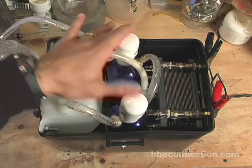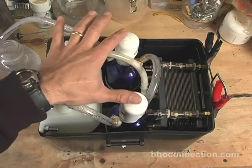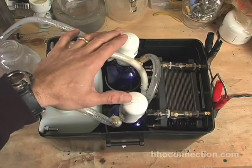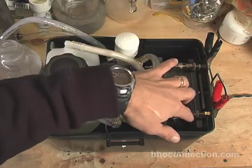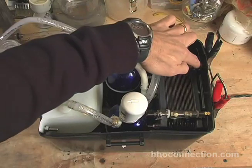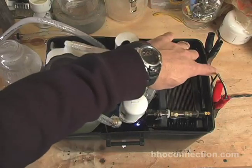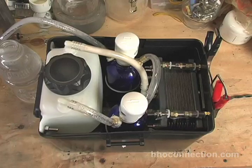I've added a couple of bubblers that are actually stainless steel bubblers. I have two bubblers and scrubbers with flash ports on them. Again, I can't stress enough — you've got to have flash protection. The other thing that I did was I took the bolts that I've connected all my dry cell connectors to. Before I just had a couple of wires draped over the back which was temporary. Now I took longer bolts, ran them all the way through, and it makes for nice little terminals that I can just clamp onto on the outside of the battery box.